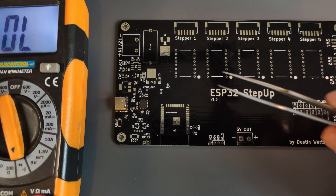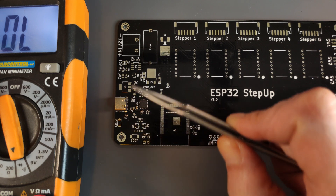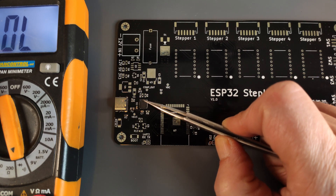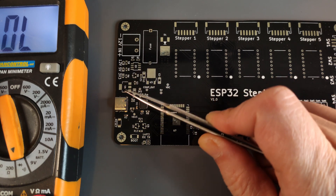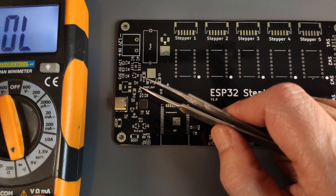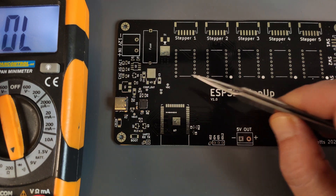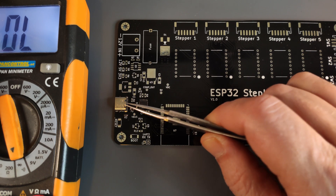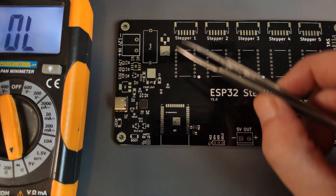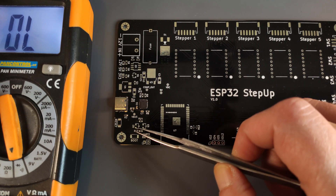Once I got on the realization train, I realized I'm also going to need the 3.3V regulator, which means I also need the 5V regulator, because V-Bus goes to the 5V regulator, then to the 3.3V regulator, and then the CP2102. So I also need the whole power section of this circuit, and I'm going to do that in the next video. You've seen how I solder surface mount chips without a stencil. The fine pitch of the CP2102 and the USB-C connector is just too fine for me to do by hand. In the next video, I hope to finish the power circuit and see if we can get a serial connection between my computer and the CP2102. Bye for now.